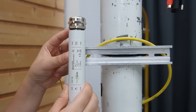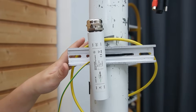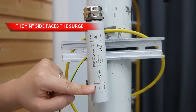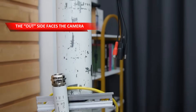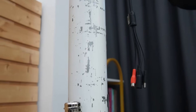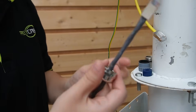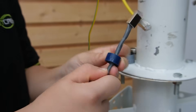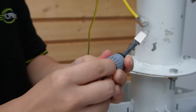Installation is easy. We mount the surge protector on the DIN rail near the camera on the pole — the closer the better. Think of the device as a security guard at the door: the inside faces the surge, which will be our 100m ethernet cable, and the outside faces the camera. First, let's connect the inside. This is IP67 rated, so make sure you do it right — put the cable through the gland, then use the rubber around the cable, and push it in. Make sure nothing can get in.